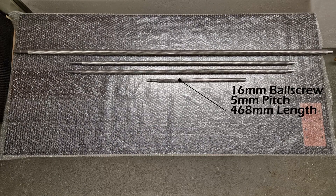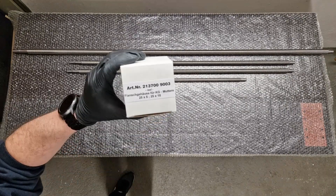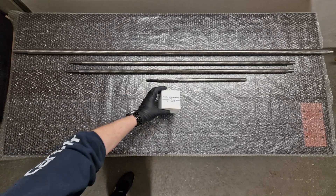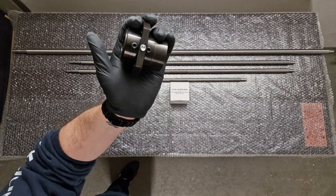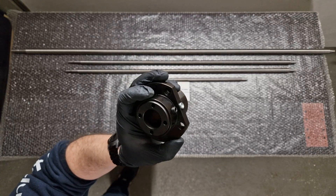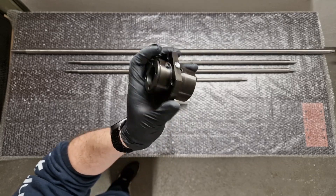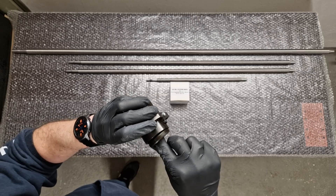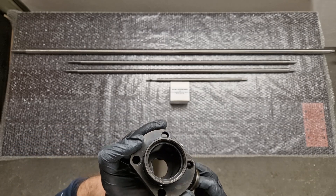The 12mm spindles are only available in 2.5 and 5mm pitch. The end machining I got is up to Easel standard, but if you have a special application for your ball screws, you can send Easel a technical drawing of the end machining you need and they will machine it for you. All ball screws I got are machined up to tolerance class seven.